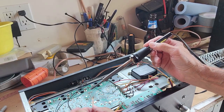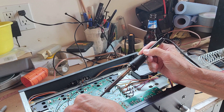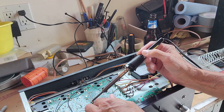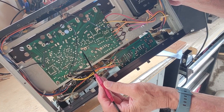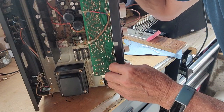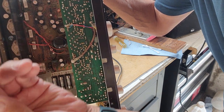I like to use a solder wick to take up the excessive solder on the bottom of the pegs that come through from the capacitors — just a matter of soaking it all up and pulling out the capacitors. So I've removed the solder from the three feet of the capacitor, as you can see there. The solder has been removed. Here are the capacitors — we just remove them. That's what they look like on the bottom.